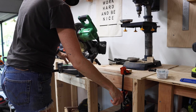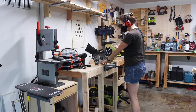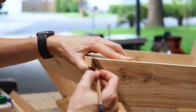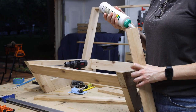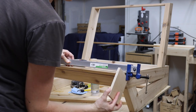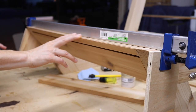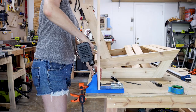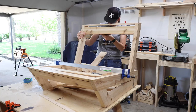The seat slats for this chair are all going to be the same size, so I set up a stop block with a clamp at my miter saw station and made a bunch of repeatable cuts. The only slat that will be different is the first one that matches the angle of the front — I trimmed the angle with the table saw but couldn't get underneath it to screw it in, so I added glue and clamps and left it overnight to dry. The next day I added pocket holes to the back of my seat slats and started adding them in, using glue and screws along with an off-cut as a spacer.